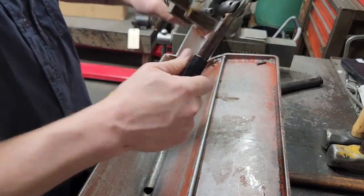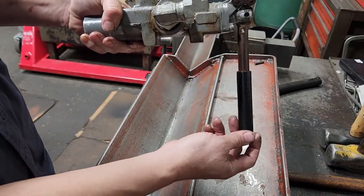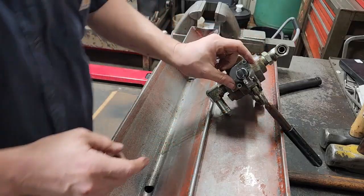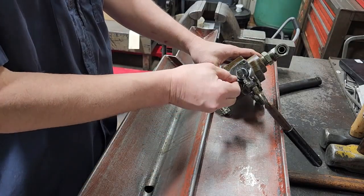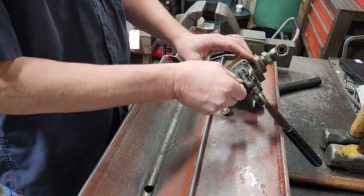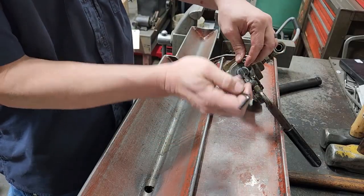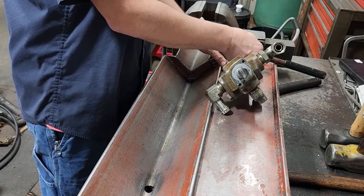The handle falls down. The way this is mounted, the handle is towards the bottom of the valve. These are the feet for the valve, so this mounts to the cylinder. Once that's loose, there are allen screws — we'll take a 3/16ths allen wrench and take these out. Once those are loose, pull the bracket off the valve and set it to the side.